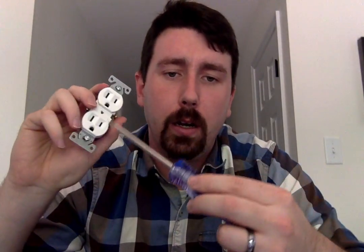You're going to go ahead and take your flathead screwdriver and back the center screw out, because on a cover plate there's only going to be one screw — that's what this hole is for right here — that's holding the plate cover over it. Back that off, and then you're going to take your Phillips head screwdriver and take the top screw and the bottom screw out of here. Those are actually holding it into the box. Go ahead and back those off and take it out.